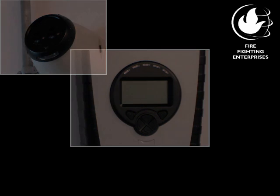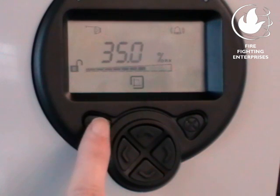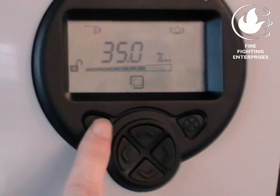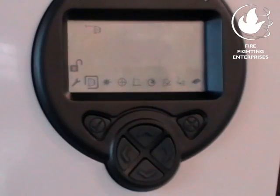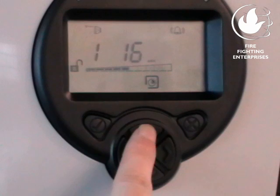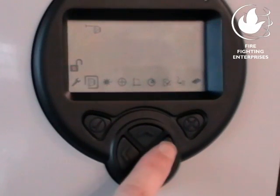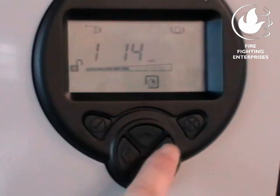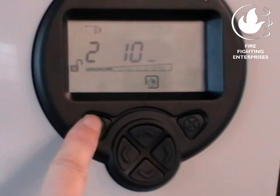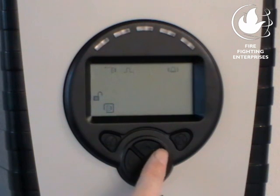And if the LCD was in sleep mode, then fire will also be shown. There are other settings that can be made. For example, the fire threshold can be set for each detector. The delay to fire can be set for each detector. The delay to fault can be set for each detector. The mode for the system can be set to latching or non-latching. Refer to the user guide for further instructions.